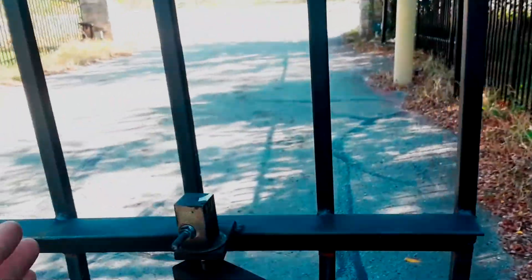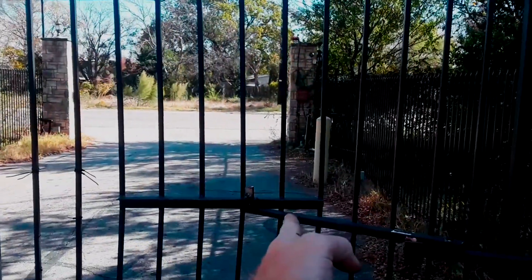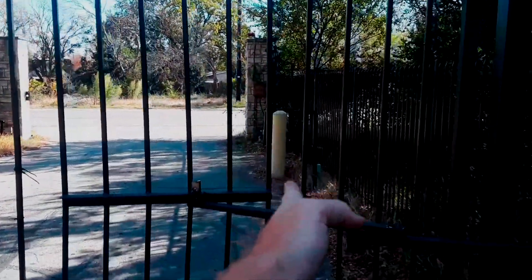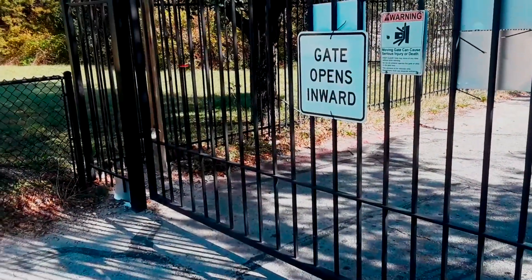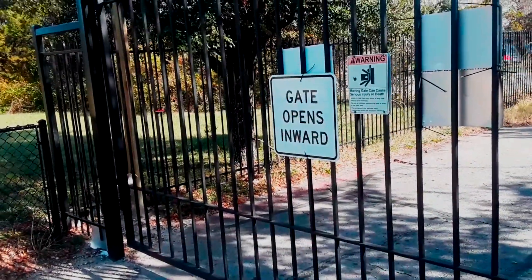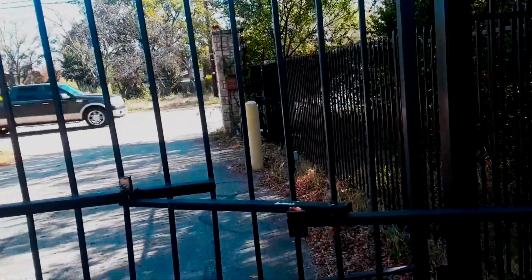You can see that the distance has changed from where the arm connects to the gate — it has moved back an inch, maybe even an inch and a quarter. That's caused this arm not to lock in position, and if the arm's not locked in position it makes it easier for the gate to just be pushed open manually. I've overcompensated it a little bit, and that'll make it that much harder for it to get pushed open. The way it's set up, it'll be tougher to pull open as well.